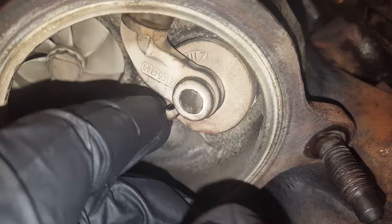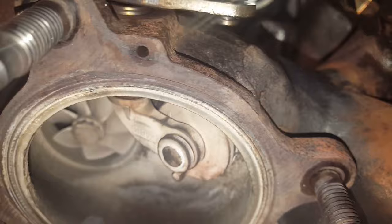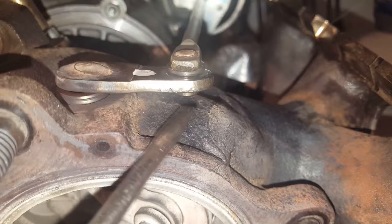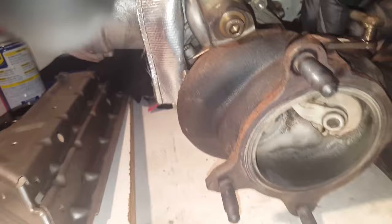What I'm going to attempt to do is remove the pin. There's a little locking washer that goes on the bottom right here, so I took the washer out — it looks just like this, one of those lock washers that keeps the pin from coming out. All you do is just pry a screwdriver under it and get it out, it's relatively easy. Then this should pop right out — there you go, see, it pops right out. I'll just put that to the side.